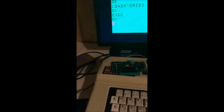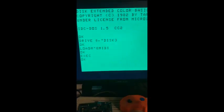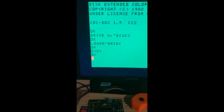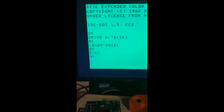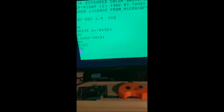Yes, sure, you can get some stuff to work through the sound line without interruption. An example would be John Linville's Farfall. He's only using the X axis. Of course that wouldn't disturb the sound, because it's using the same mux bits as that measurement can be done on the joystick. But as soon as you change the mux bits around to measure the y-axis, you get a cut in the sound. Having an audio out jack, you get no cut. It's undisturbed music. It's perfect.